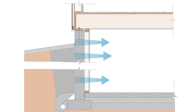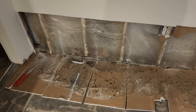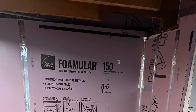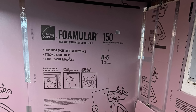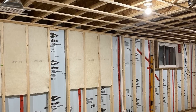Are we using it as a capillary break? That might work. But at the end of the day, you're still going to have moisture that's drying out of that foundation wall. If that house wrap is vapor permeable and you have a vapor barrier sheet of polyethylene on the interior side, that's going to trap that moisture in the wall. Also, if you don't perfectly air seal that vapor barrier membrane, you're going to have air leakage into that cavity, which will result in condensation on the backside of that house wrap or on the concrete block wall. My preferred approach is just to install some taped rigid foam insulation against that block wall, providing the benefits of a vapor retarder, a thermal break, and an air barrier, preventing warm moisture-laden interior air from condensing on that cold block wall, and then allowing that stud cavity to dry back to the interior.